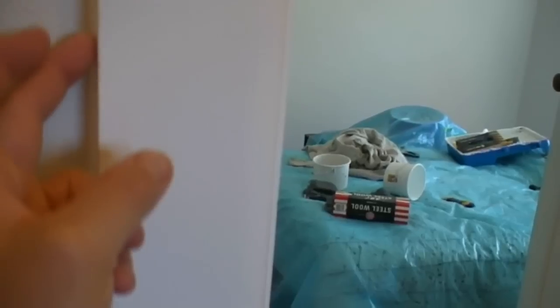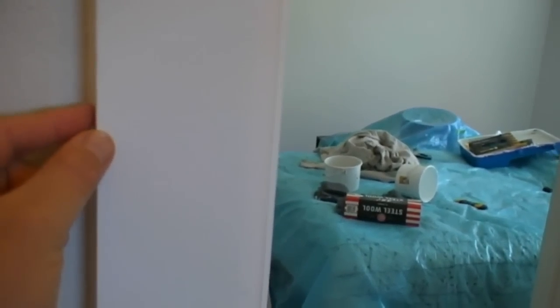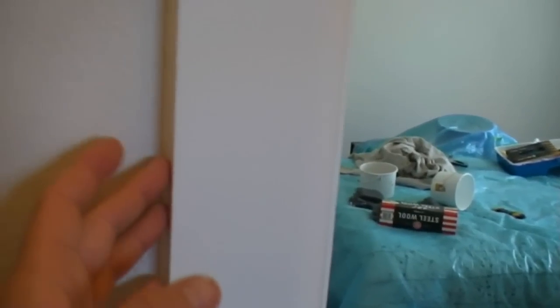you got to sort of, especially if you're cutting in the architrave to the wall, rather than just painting over the wall and cutting in the wall later. So if you have to cut in the architrave to the wall, then obviously that's more fiddly. That's going to take even longer. So that will make it even harder to keep a wet edge.